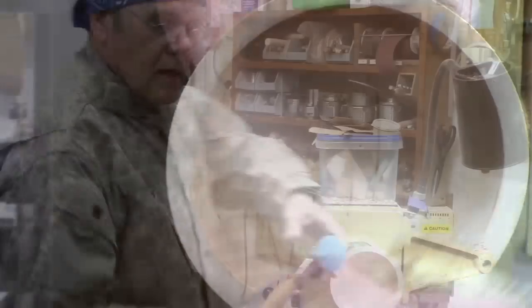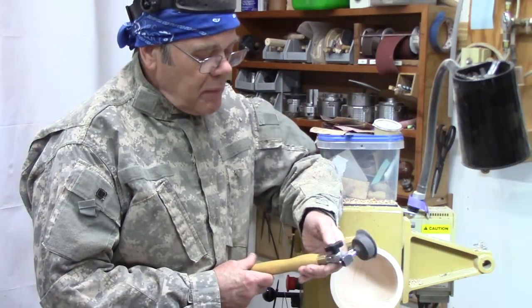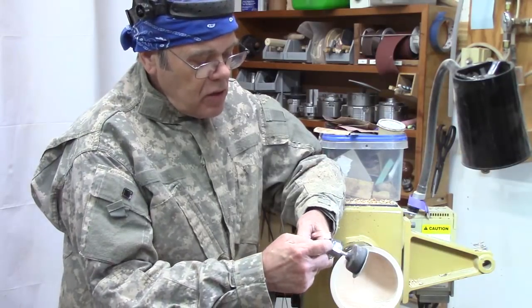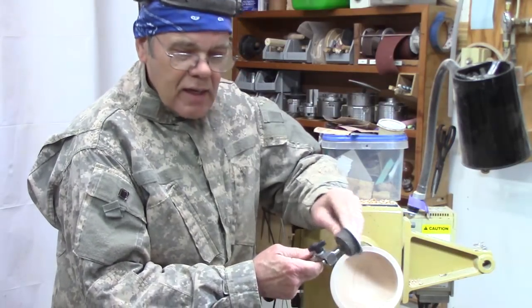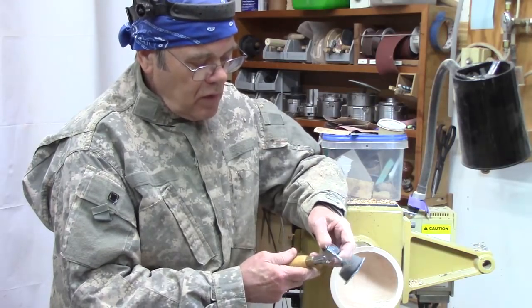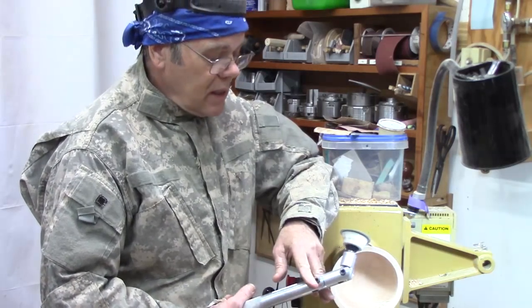I like it. When I first started turning about 12 years ago, I got one of these inertia sanders with my mini lathe — I think it was Penn State, but I couldn't swear to that. Sorby has one, but it doesn't have Robert Sorby on it. The problem I had with it is it had a little wear — it doesn't use a bearing; I think there may be a bronze bushing in there. It shimmied too much after a little bit of use, and it has such a long area that accentuated that. So I quickly moved on to a power sander. But after using this one with its nice substantial handle, I think I'm going to go back and play with this a lot more because I think I'm going to like it.